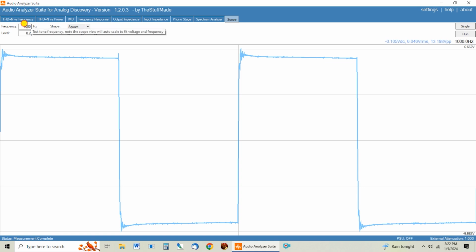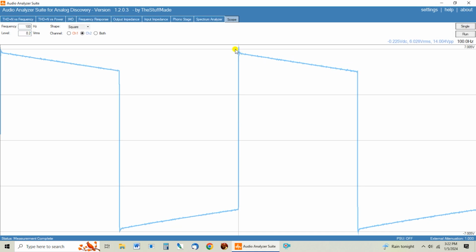So let's look at the low frequency with these Western Electric tubes. That looks good. Like I said, just a little slight overshoot there right at the start. Doesn't bother me at all. And then let's see what the 10K looks like, to see if we still have the same kind of ringing that I might need to tune out of the feedback loop using these Western Electric tubes.